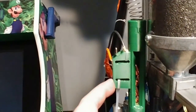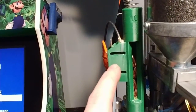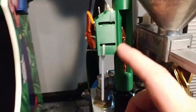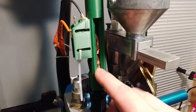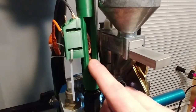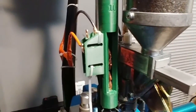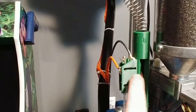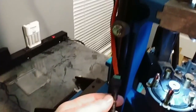Your drop tube right here holds your switch. There's an important factor — this switch is a low mass switch, this is a .29 newton in order to activate it. I'll put a link below where you can find that; they're actually pretty hard to find, low mass switches like this. Even at .29 it's still too stiff — it takes 2 to 3 bullets to trigger that. We really need a .06 newton, which is going to be almost impossible to find on a budget. These are like $3 or $4, compared to $30 to $40 and up for a switch that precise. They also have different drop tubes for an optical sensor — you wire it in the same way, just run your wiring switch with a quick connector.